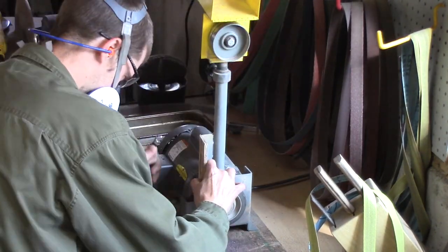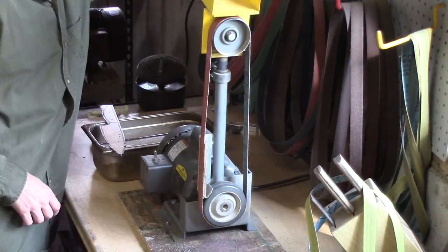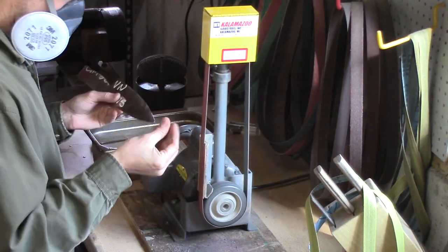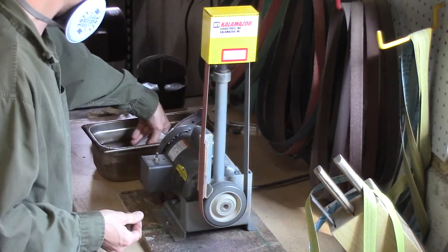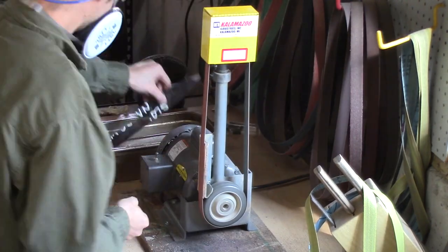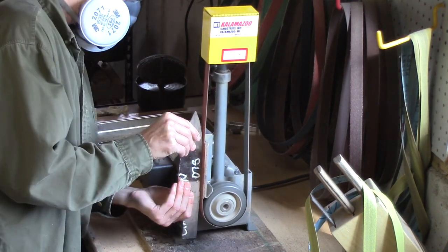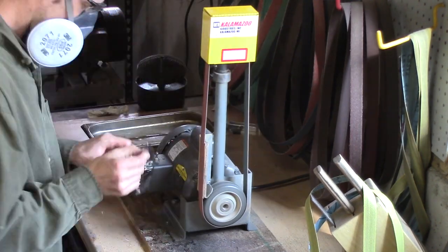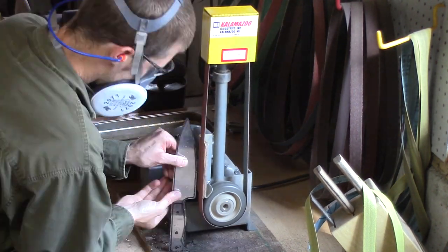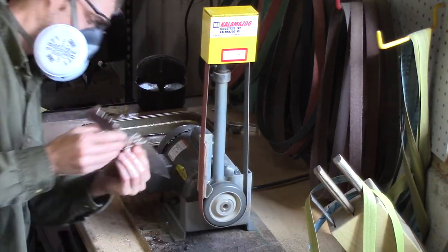Here I'm attaching the platen for running some flat surfaces. Something that I found that works really well for me are stacks of leather on top of the platen surface, just adhered with some contact cement. It's pretty easy to change out and it's fairly forgiving. Some fireplace glass is of course the preferred material, and it works very, very well — it's not aggressive on the sandpaper backing.